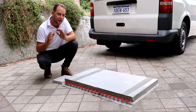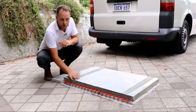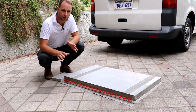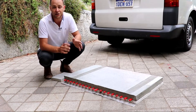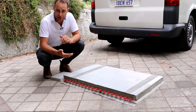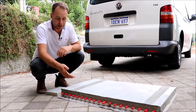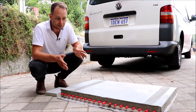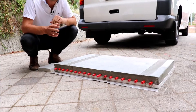Basically, why screeds are used is because they separate what you're heating or cooling from the rest of the building. That's important because you can get a lot of heat losses or energy transfer into different parts of the building if you don't have the thermal insulation. For example, here we have 25 millimetres of polystyrene, which is a pretty standard insulation thickness for screeds in Australia.